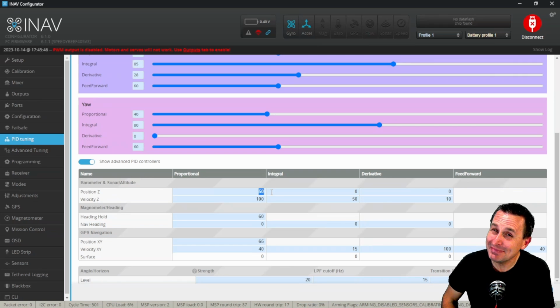However, it can be more complicated than that because we have this dual controller here, which I really wish we didn't have, because this altitude parameter is telling this velocity how fast to go up or down in feet per second, meters per second, that it could be this overshooting. So the other symptom that you generally see with altitude hold is it's not reacting fast enough.